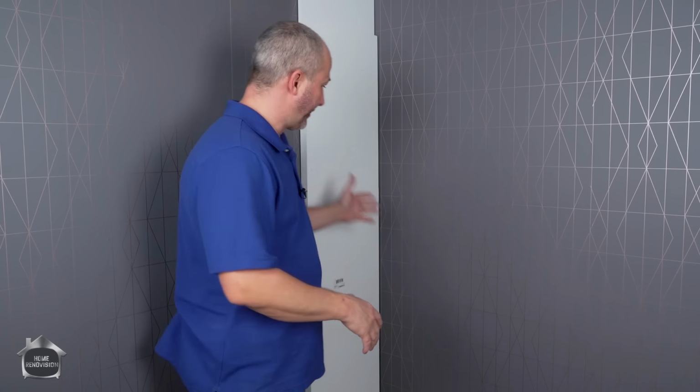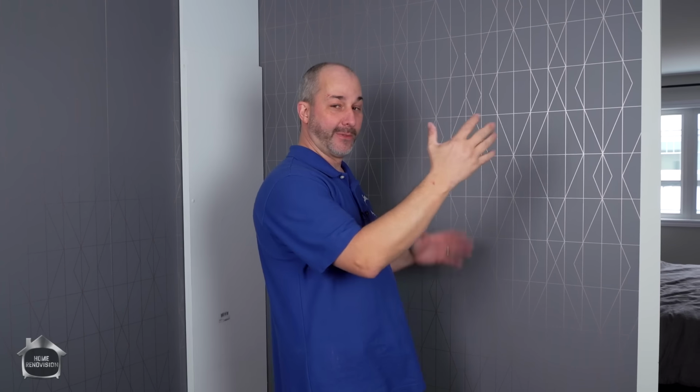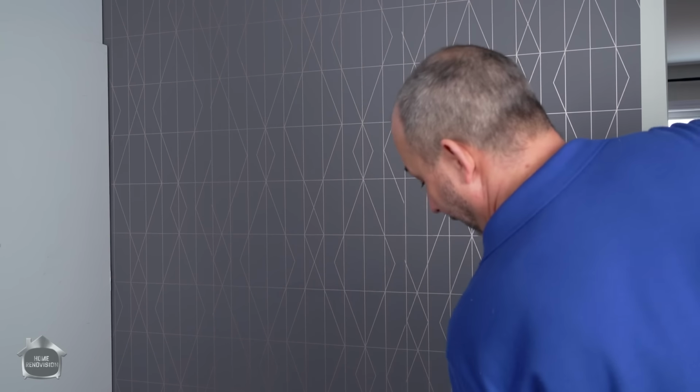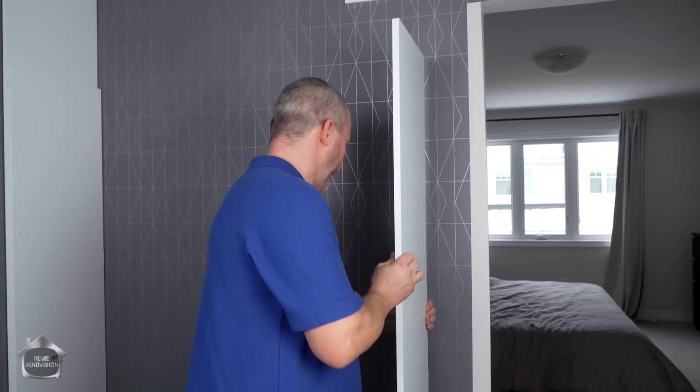The next step is, for this section of the closet, is to build this side. It's gonna be very similar. We're gonna have one panel that goes to the ceiling, one panel that comes from the store at the same height, all right? If your room is level and relatively flat, that makes all the math really simple. So we're just gonna screw those together, get that in place. And that's my right side panel here.